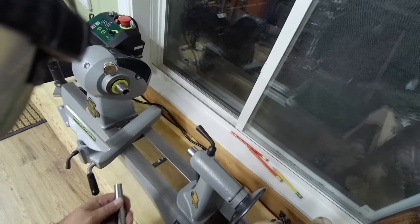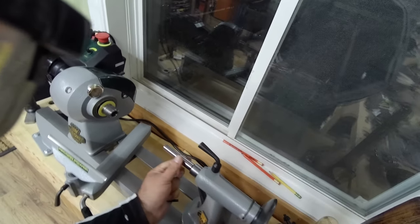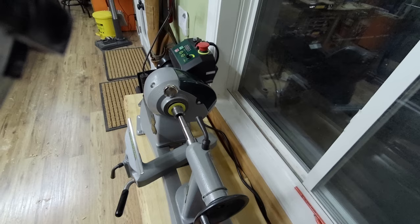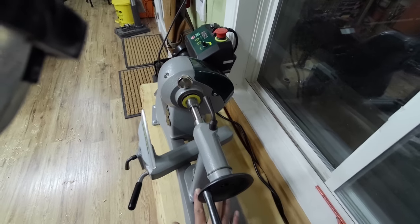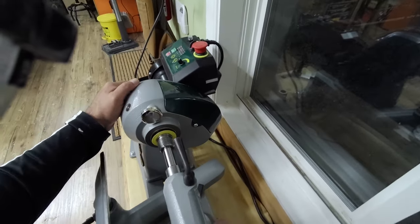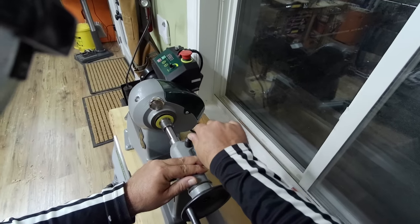As you can see, it can now move freely. Pull this out a bit so that the MT2 goes all the way in, and slowly bring it in. Don't try to manipulate it — just push it in, let it do what it's supposed to do, and it will center itself.